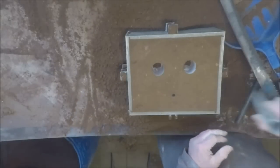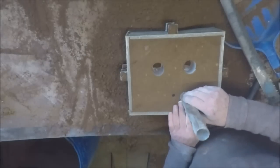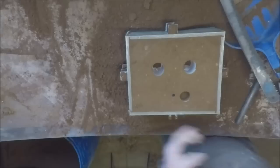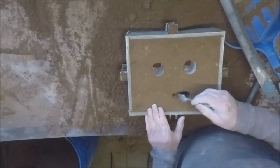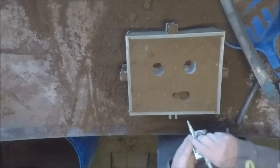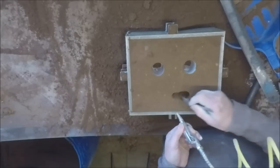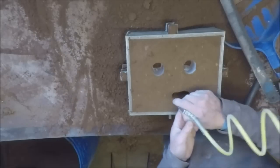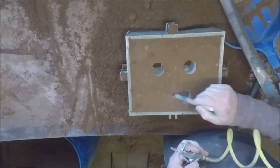Now I'm experimenting with pouring basins a bit at the moment, and this is the new one. First of all we cut a hole there, down about that far — maybe a little deeper wouldn't have hurt, but that'll do. We cut most of this intervening area out, but not quite all of it. The idea is to leave a ridge between the basin proper here and the sprue there. There's a little bit of a ridge — a little bit. Now we smooth it all up with a brush, radius that and smooth this a little bit.